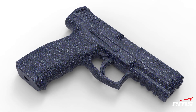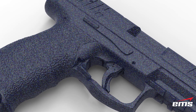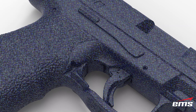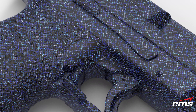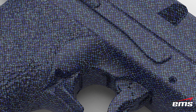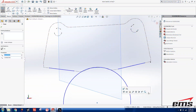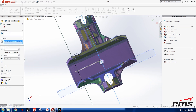What are the 3D file output options from a 3D scanner? The 3D data exported from a 3D scanner is called a polygon mesh — basically thousands, or usually millions, of triangles. The problem with this format is most CAD systems can't do anything with these files as they are. This requires specific software that can convert the model from a polygon mesh to a usable industry standard CAD format like IGES or STEP. However, this translation process is not automatic and can take hours to days depending on the customer's needs.